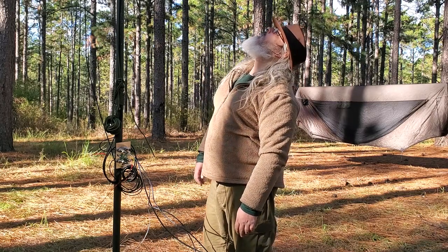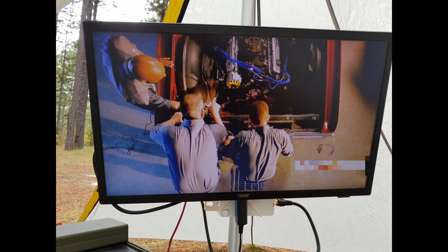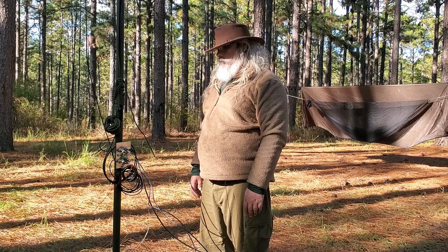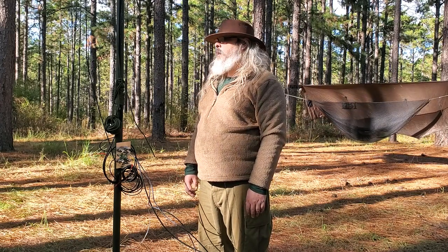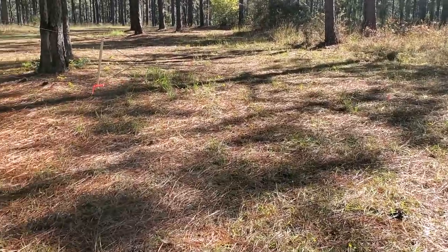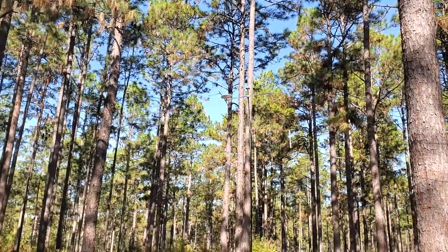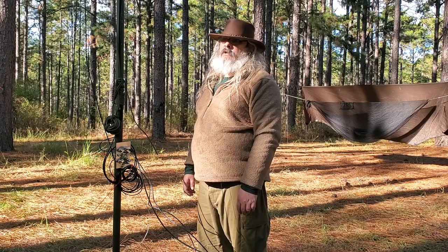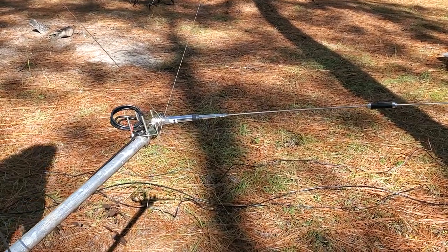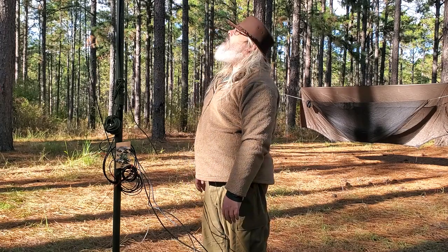We'll show footage of what it looks like at the top. Currently we have an HD TV antenna hooked to a television so I can watch local news and weather radar during inclement weather. I have a T2FD — a terminated folded dipole, two elements in a loop going to a terminating resistor. I also have a tri-band antenna covering 2 meters, 220 MHz, and 440 MHz, and space for a discone for wideband receive.